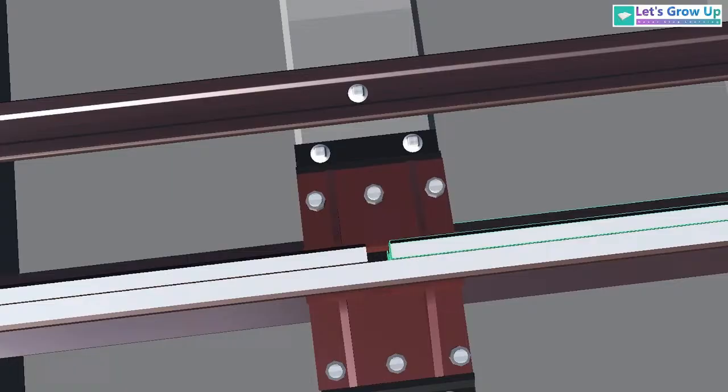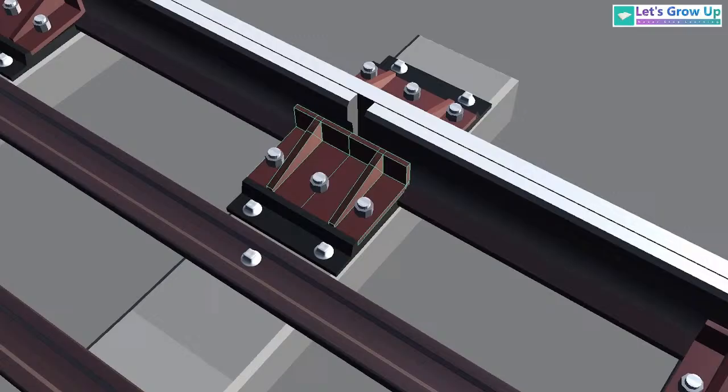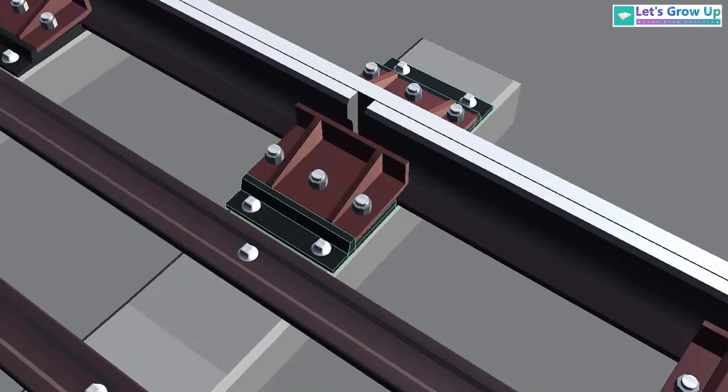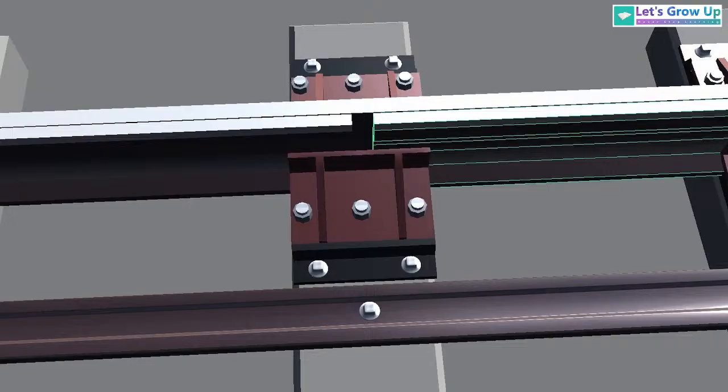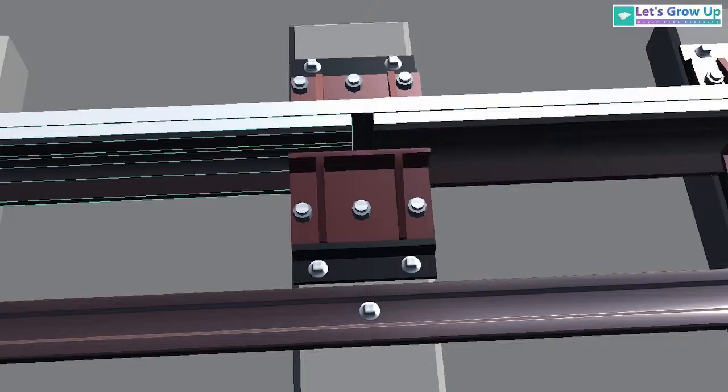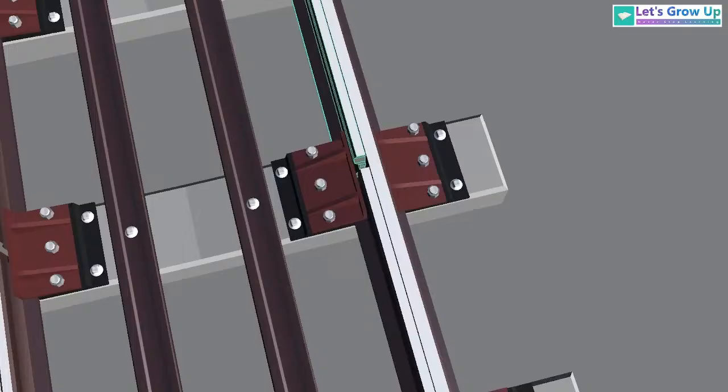On the running track, between the two rails there is a gap, and additionally there is a cast iron chair used here. Below this is a base plate — so sleepers, base plate, and cast iron chair. You can see the space clearly. During summer or temperature variation, the rail can increase in length or contract, which is why this space is very important.